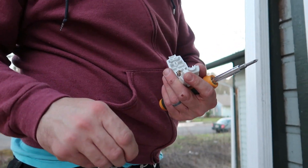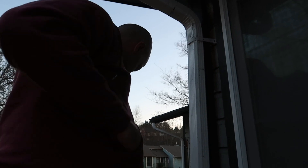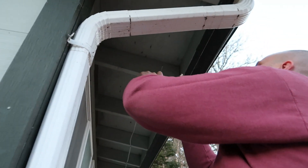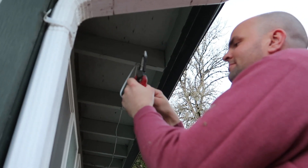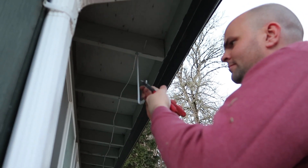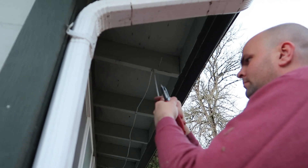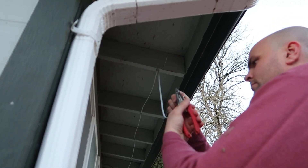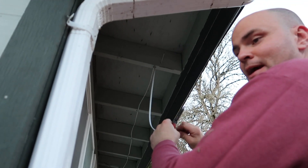I'm putting an end on the wire there so I can add on to it in the future. Again, rib side is the neutral, smooth side is the hot. And we'll have a DIY on fixing up our patio here shortly.